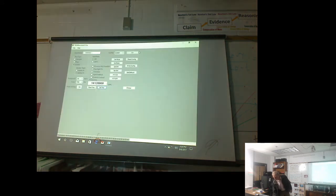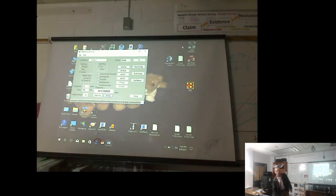The window bigger. Also, what is CWR? What's that? What is CWR? That's where, in one version, CW has the transmitter frequency above the receive frequency. And if you put it into CWR, it puts the transmit frequency below the receive frequency. Reverse. So it just switches the band, or not the band, but the sideband.